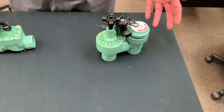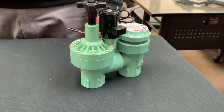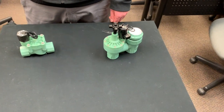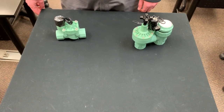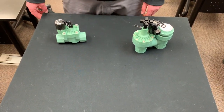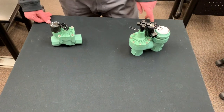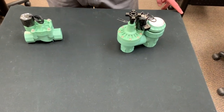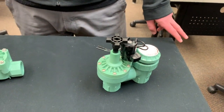The reason anti-siphon or backflow prevention is important is because your water is coming through your sprinklers at very high pressure, and when that pressure stops and the valves turn off, it causes a vacuum or siphon effect that will suck water back in. This is dangerous for residents of the home because sprinklers are out in dirt — there can be composting material like grass clippings, bacteria in the mud, chemicals like fertilizers — and even microscopic particles can get into your water supply. That siphon effect could suck those back in and contaminate your drinking water, so you want to prevent that.